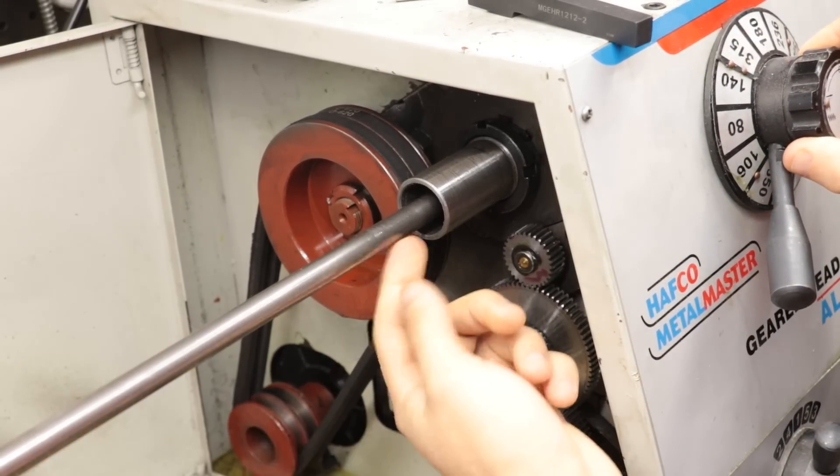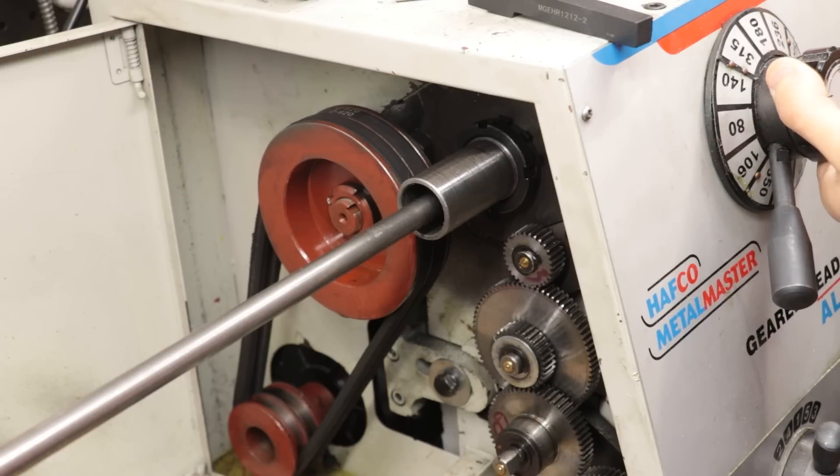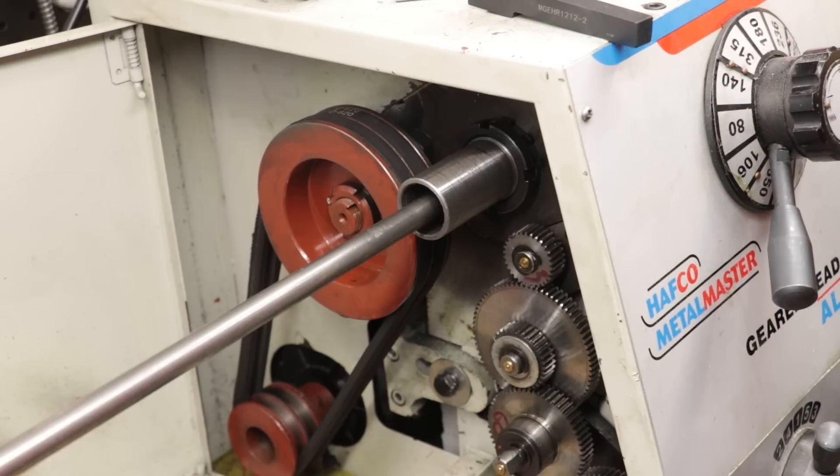The other fix, which is what I'm going to attempt here, is something called a lathe spider. A lathe spindle spider is a sleeve that slides into the back of the spindle — you lock it in place and then use a set of screws to hold the stock concentric. It's not too different from a steady rest except it hangs out on the back of the lathe and attaches to the back of the spindle. I've seen designs where the sleeve fits inside the spindle bore, but on this lathe the bore is so small I couldn't afford it to get any smaller, so the sleeve needs to fit on the outside of the spindle.